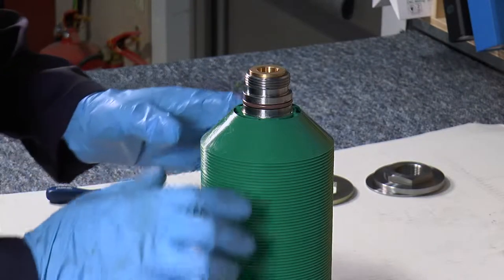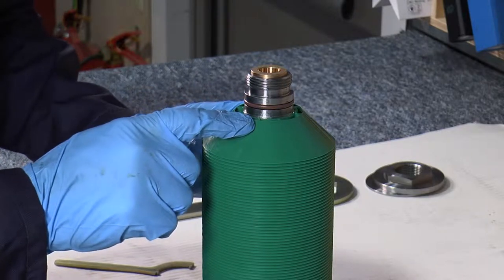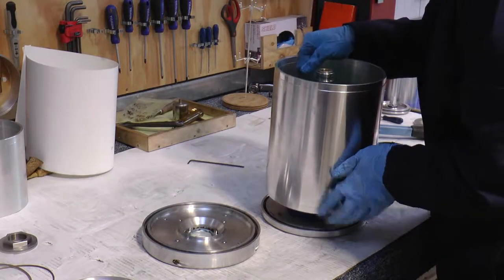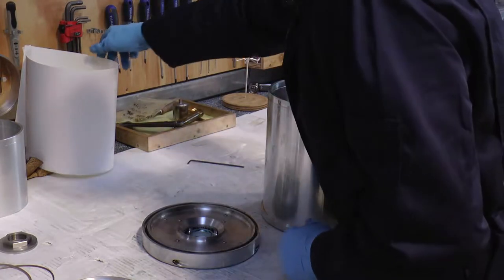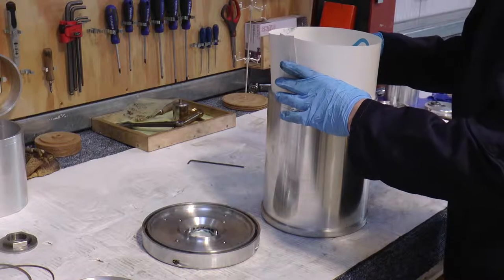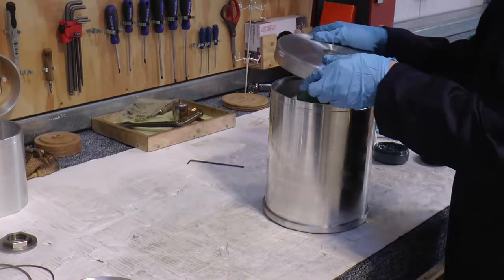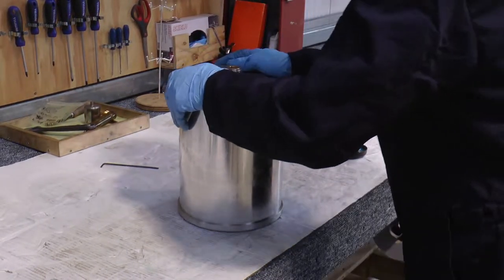One very important thing to check is that the top of the discs are level with the step in the bearing tube. If you can't see a gap then it's absolutely fine, but if there is a gap between the top of the discs and the step then you'll need to add additional discs. Next, replace the cleaned bowl wall, put it over and secure. Then replace with a clean paper insert — this makes the cleaning easier next time. Finally, replace the top turbine and push down securely.